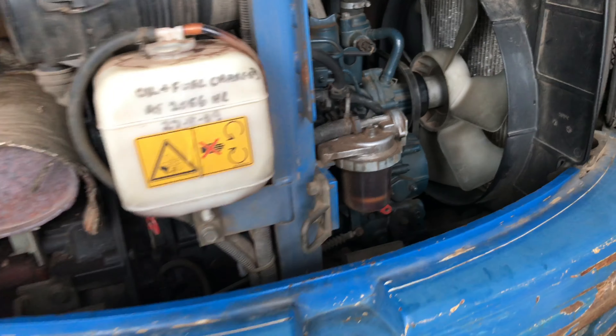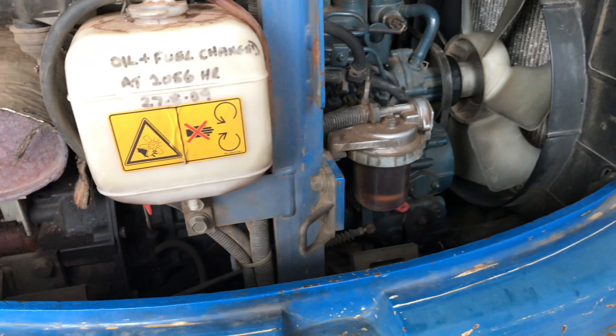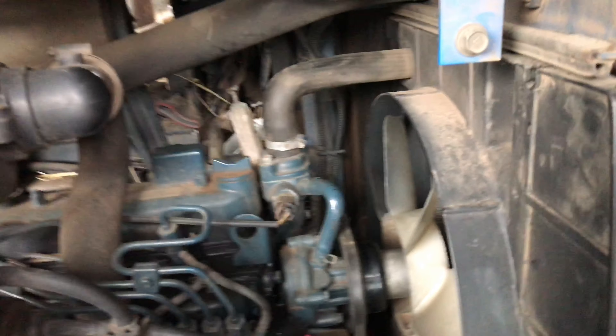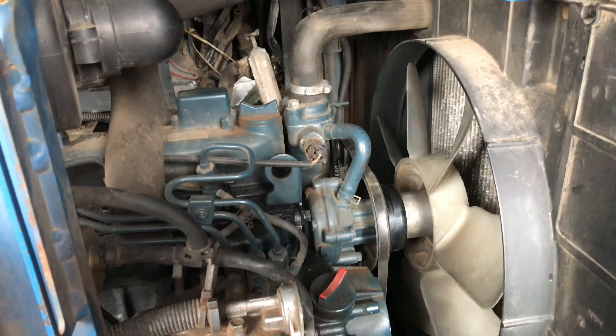So any diagnostic sockets on this? No. So the problem is the alternator - it's not charging, so he changed the alternator, still no joy. So he gave it a direct feed. Where is the alternator, Brian? At the back. You go in the cab and then you fed it 12 volts and the thing sprang into life.